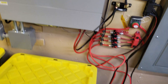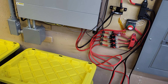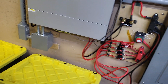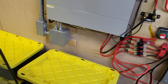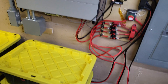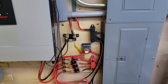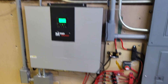There was a little bit of a curve to get these to balance out once they were put in parallel together, but I don't have any significant voltage differences between about 10% and 92% state of charge. Around 80% I have almost completely static voltage. You do get some weirdness in the extremes with lithium iron phosphate — I don't know anything you can do about it. Anyway, if you have any questions post them down below. Recommendations or thoughts, by all means I'm all ears. Appreciate your help and thoughts, thank you, see you in the future.